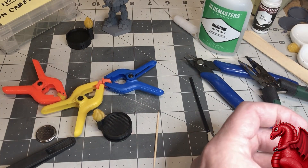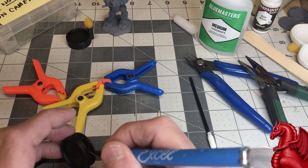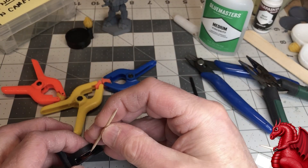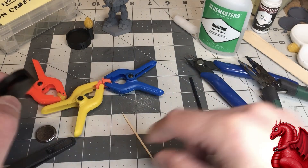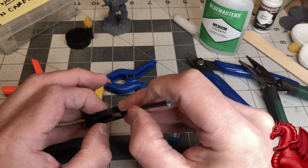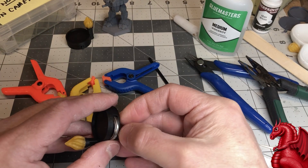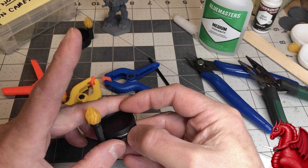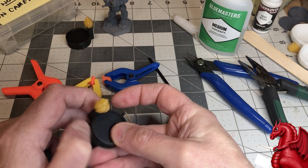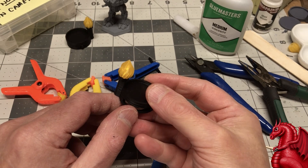With enough pressure it makes contact and turns the LED on, but I need to layer up some additional copper tape. I'm going to add one more piece on the bottom — I've got two on the top and only one on the bottom. Add another one on the bottom, try to keep it even, burnish it down, and swab it all the way to the back. Run another test — you just want it tight enough that you insert it and it pops the light on. The light is on this time without holding the battery. You can see it flickering.